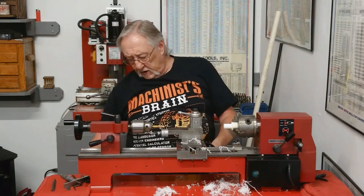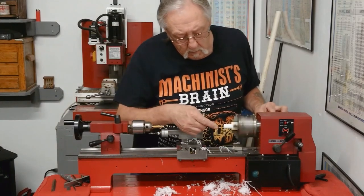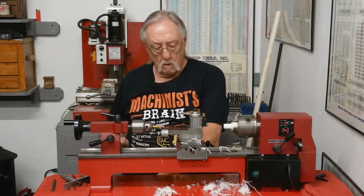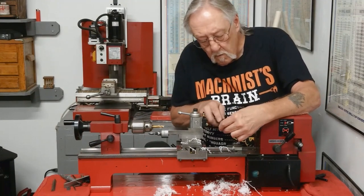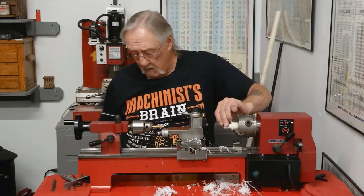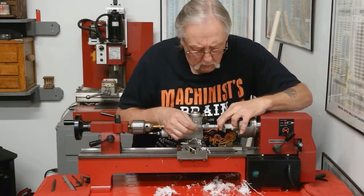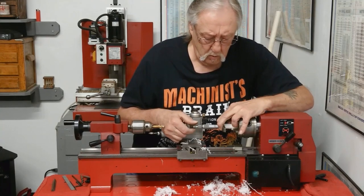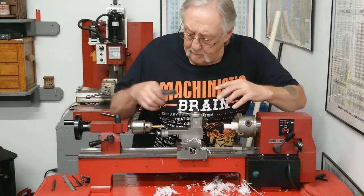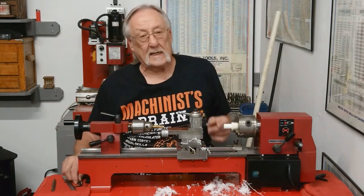Okay, find a countersink, and a little file. Better. The drill didn't leave a burr really, but that end mill did. Well, my scale depth measurement, I went 20 thousandths past it. It was 770. I could live with that.